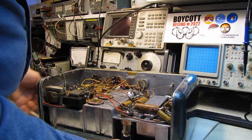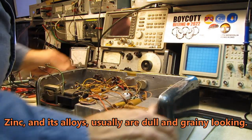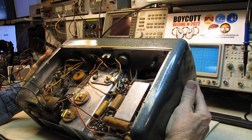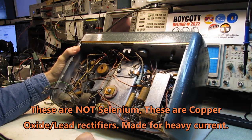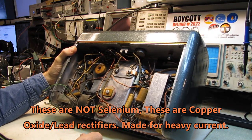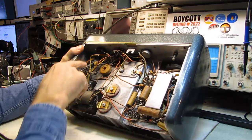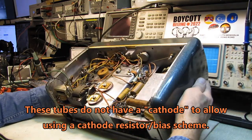I did look up methods you can use to determine if it's aluminum or not, but I don't have the chemicals available. Here's the inside — built like a battleship. These are the rectifiers for the battery charger. From what I remember on the schematic, this is a choke for the filaments, the filaments in these tubes. These are one- or two-volt tubes. And we have in here a bias battery for the audio output tube.